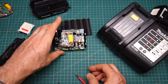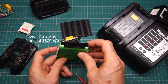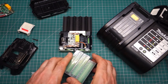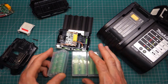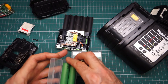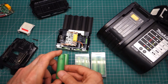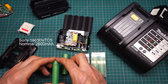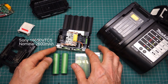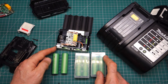In terms of the cells, there are five cells in here. I looked up the part number on the side and discovered these were actually Sony cells. So I decided to replace like with like and I've got myself six cells here. These cells — this whole battery pack and drill setup is a number of years old — so the cells I've got here are actually a better cell than what's currently in the pack. They have a higher milliamp hour rating, which I'll put on screen, and I'll put links down below. So I'm going to remove all these batteries from this pack, replace them with five of these brand new ones, solder everything back up and see if it works.